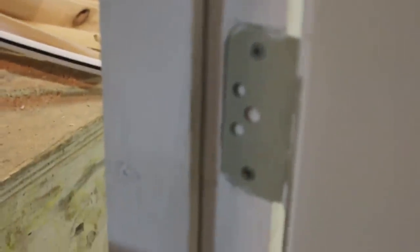I only put two screws in each hinge - those are for the three-inch screws. I always shim my doors and put three-inch screws through the jamb into the stud in the wall so the door is held in place. I leave the other screw holes out on every hinge because I put three-inch screws in there - I don't like my doors to move. At the very bottom I have a piece of wood stripping across the bottom that holds the door jamb together until I get the threshold put on. I'll wait until it's in the house to do that because I need to put a sweep under the door first.